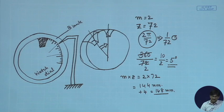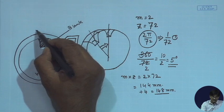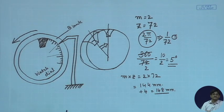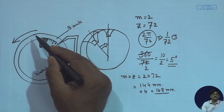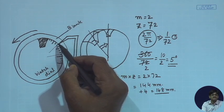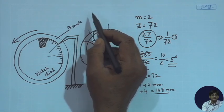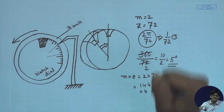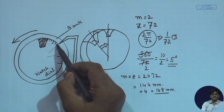So, what we do is, we have a device which can rotate this blank, but from a source where a huge amount of rotation will be giving rise to just one rotation of this blank. So I'll have more control. If you ask me to move by 1 degree, which is difficult, or say 0.5 degree, which is difficult, instead on that initial rotating object, rotational handle or crank, I will give 20 rotations, so that those 20 rotations will correspond to maybe half a rotation here.